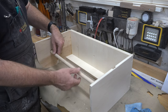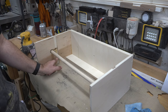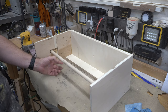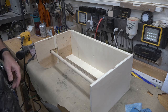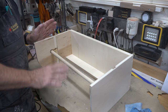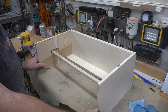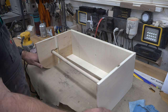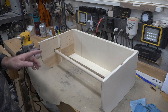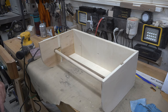Once you get the dowel cut, it will slide right into our dado area and down into the smaller section. Don't slide it past where I messed up — I said that was for adjustability, sure it was. We're not quite done because there is some flexibility between the two side sections, and I don't want to just leave it like that — I want to get a brace support across there.